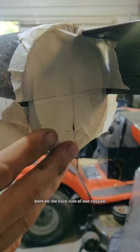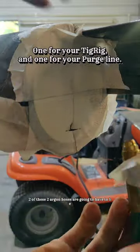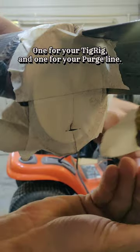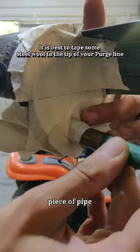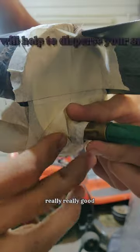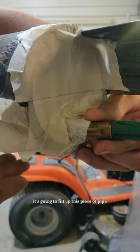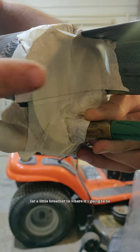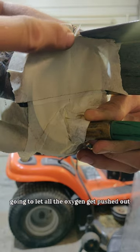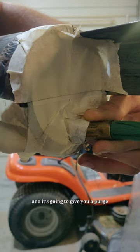On the backside of our coupon, I've cut a slice in the tape. I've taped off this entire backside of this pipe. We're going to take our argon hose — you'll need two argon hoses run into your workpiece. We're going to tape all the way around this piece of hose, poke it inside the piece of pipe, and tape it up really well. If you feed your argon from the bottom of your coupon, it's going to fill up the pipe. On the opposing side, you'll put a little breather hole at the top, which will let all the oxygen get pushed out and completely fill the coupon with argon, giving you a purge.